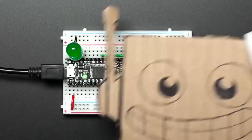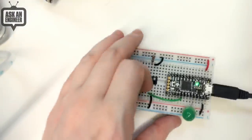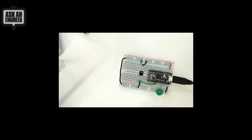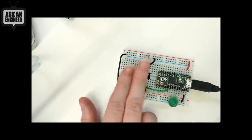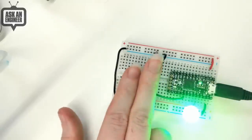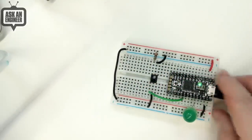Honestly, this demo kind of shows you, and I can also show it on the overhead. But yeah, this is an infrared transmitter and a receiver. You can barely see it's on, and when you cover it, it detects it. You can also use it for basic distance sensing, but what it's really good for is detecting when something is in the way, or counting ticks or movements and stuff. That's what this sensor is really good for. And yeah, this one's breadboard friendly, and they're so inexpensive, we just put them in a pack of 5.